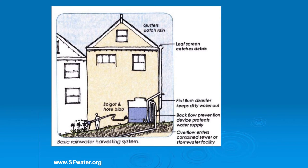Does anybody know why? Think about their utilities - water, electricity, storm. It's actually that the storm and sewer are all in one pipe. So if you have a really big storm, you're trying to get sewage out of pipes that are also trying to handle all the stormwater. So if they can get people to hold on to this water, even for a day, it makes a big difference. They really push that.